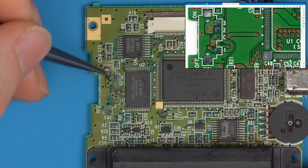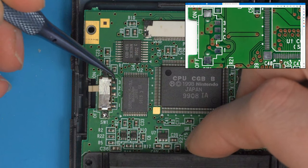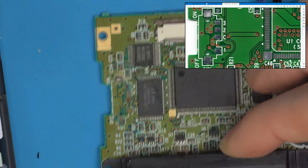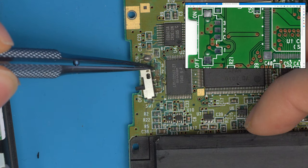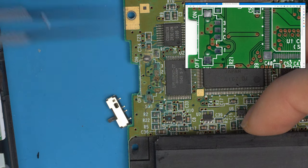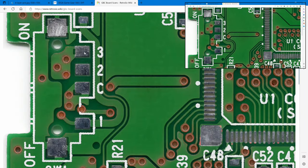We can see this trace here should have a pad, and the solder for the switch would need to make contact with this pin on the new switch. Overlaying this on the board, you can see the pad for this pin is missing, the pad for the middle two pins are both missing, the pad for the bottom pin is missing, and the pad down here is missing. The goal is to repair wherever electrically these pads used to go — that's all we're trying to do.